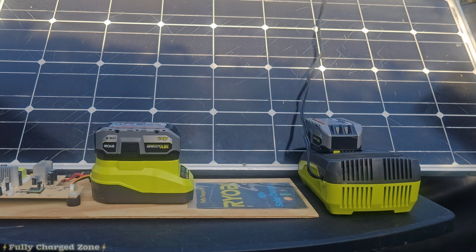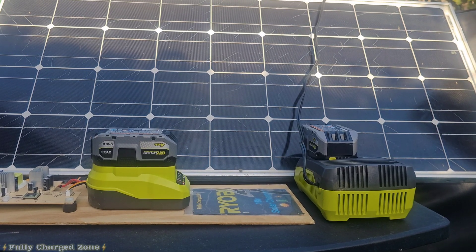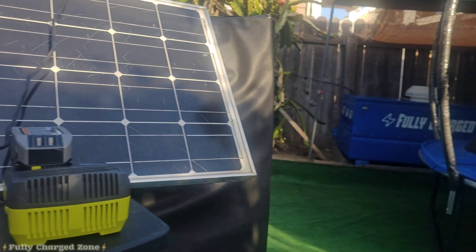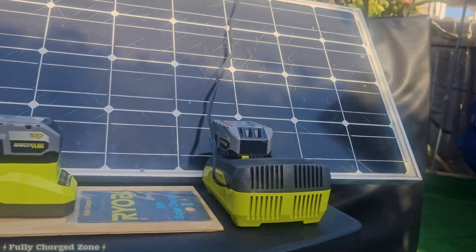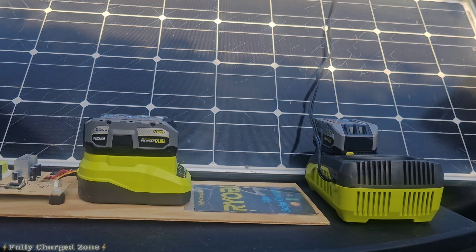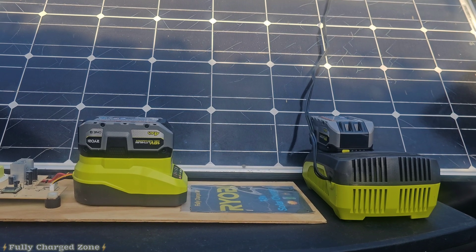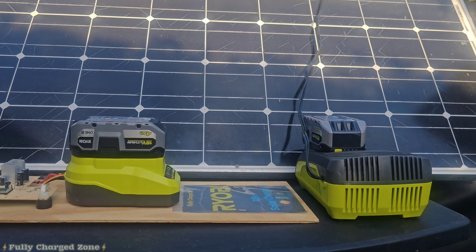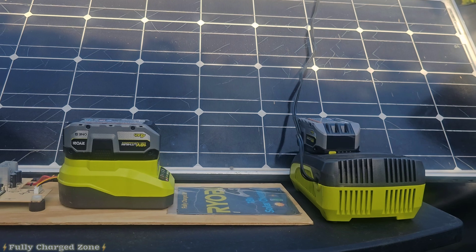The sun's going down. I think it's awesome that you can charge directly from a solar panel, but would I do it? No. I would use a large 24 volt battery charged from the sun and plug these chargers directly into that bigger battery, charging DC to DC so I lose even less energy. It's really cool to charge from a solar panel, but I recommend using a solar controller and a battery as a buffer. Thanks for watching — if you like my content please like and subscribe.